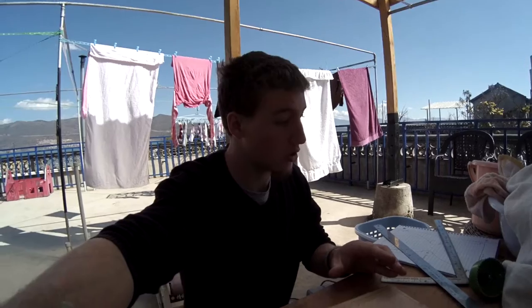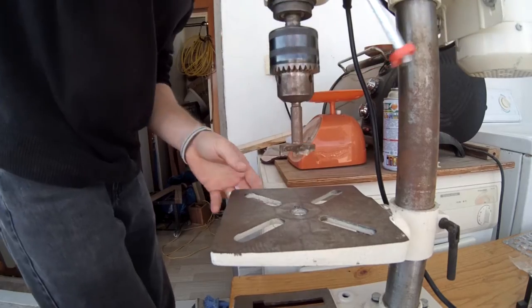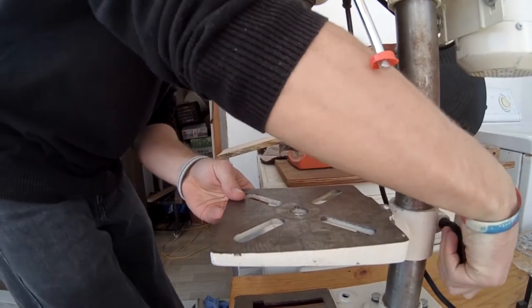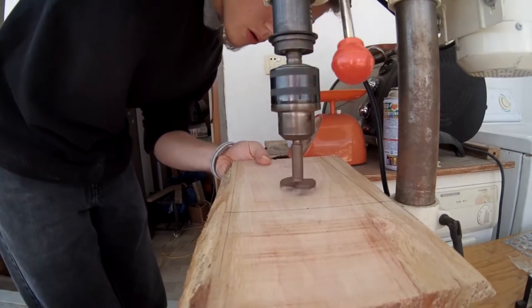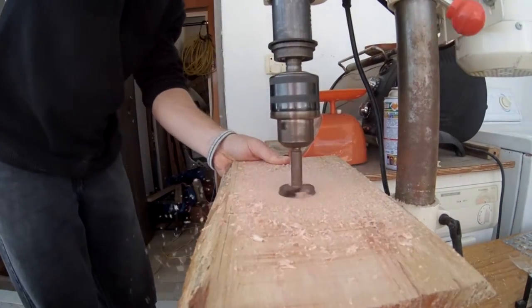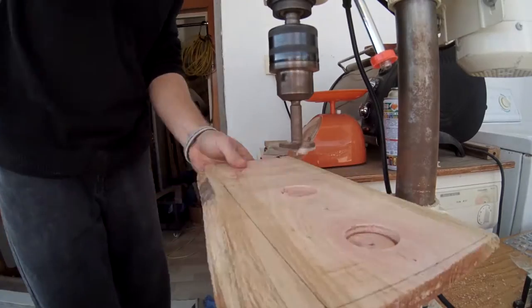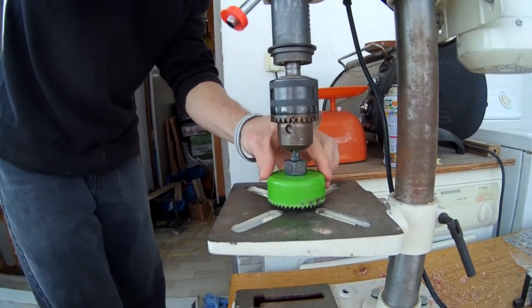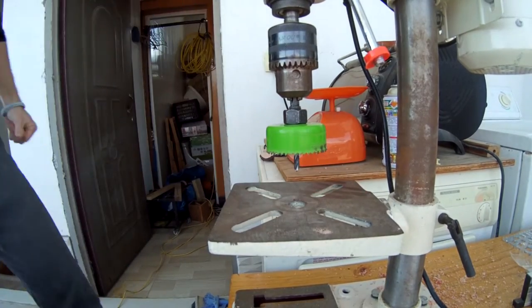That's almost the smallest bit we're going to use — it's a 40mm, which is just under two inches. I'll give you the exact measurements in the description. I'm going to set the depth a little bit deeper than that first. I've made sure my bit's not going to dig into the table at all, and I'm going to be drilling into another piece of wood underneath my candle holder.